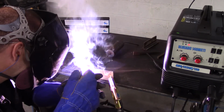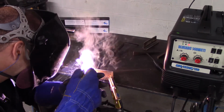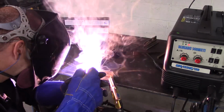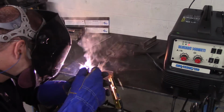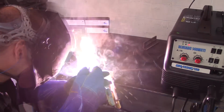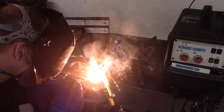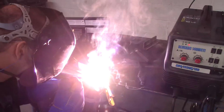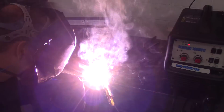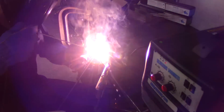When welding, you want to make the best weld you can, so you want to get as comfortable as you can. It will be well worth it if you can find something to rest your hand or arm against to make your task a little easier. For example, attach a C-clamp to your part or welding table to brace yourself. Next, make a few dry runs. This will ensure you can complete your weld and nothing is in your way.